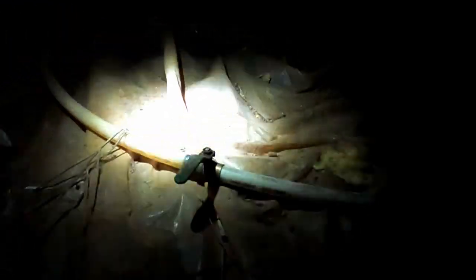So okay, y'all, this is the water line coming in underneath the ground. We have a manual shutoff up top, but it's an old CPVC ball twist and it's very, very difficult to close. There's already a leak. Oh, look at that little guy. You see him crawling? Look at him. Whew. Anyway, so I went ahead and shut it off here. And now all June and Roselle are doing are opening up all the lines, all the faucets and showers and all that and toilets in order to drain the lines so we can cut it and replace it.